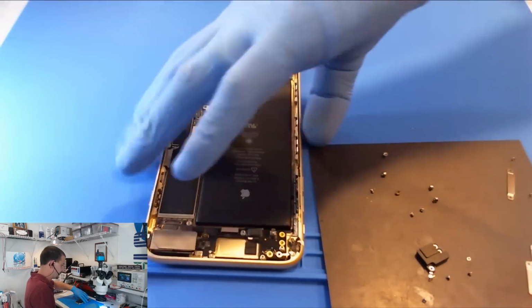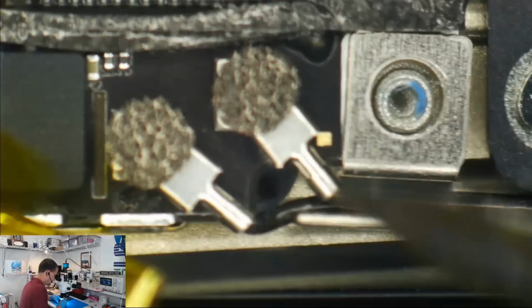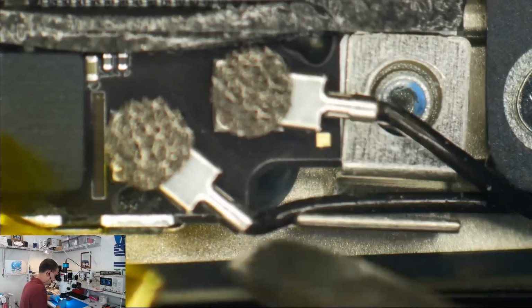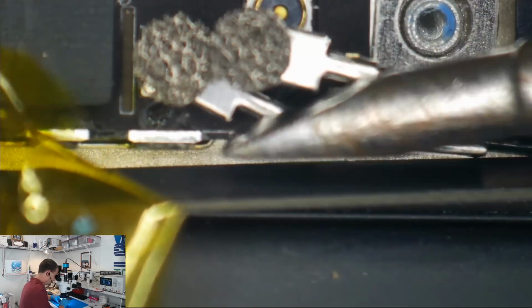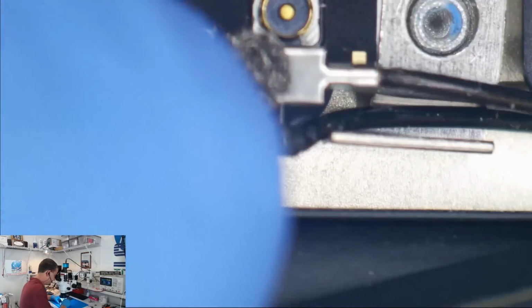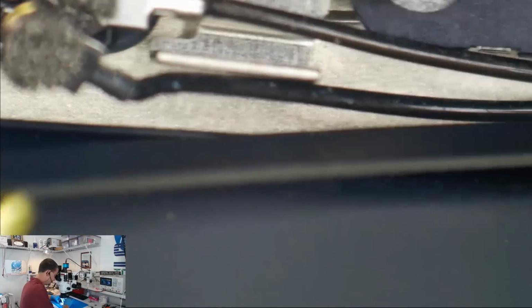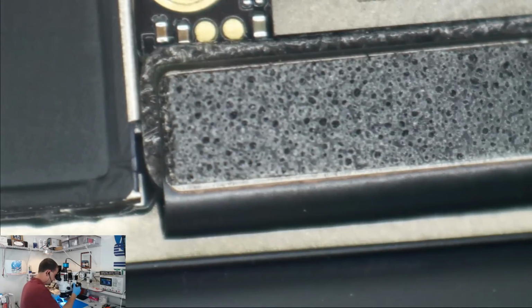Watch me find a main short, and then after I get that fixed, then that's when we'll discover our baseband, our chronic baseband illness. Now, even though this is a VCC main short, or a VDD main, or maybe boost, yeah, not boost, but even though this is a main short, I'm still going to check our baseband. One of our main baseband lines that likes to screw up on almost all of them.